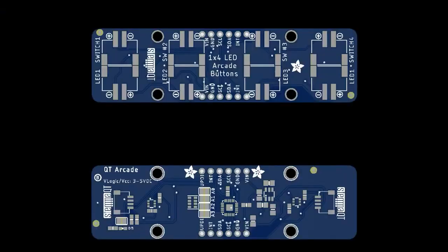This is a new design for a four LED arcade I2C breakout. It's got plugs for connecting quick connects to LED arcade buttons. These are buttons that are switches, but they also have an LED element in them. It's over STEMMA QT, and there's a little boost converter so you can use it with five-volt LED buttons, because some of them have two LEDs in series — two volts each — so you need a five-volt power supply. Hopefully coming soon; I'd like to get more of those user interface STEMMA QT boards out.